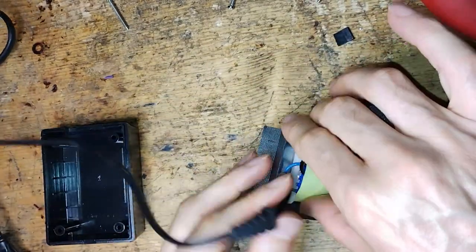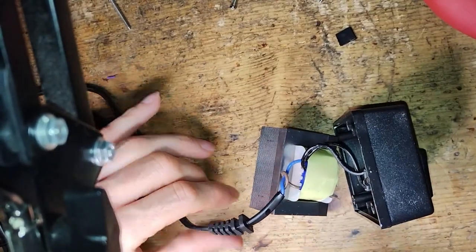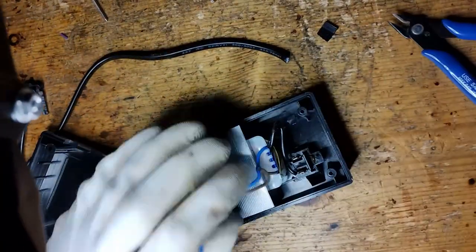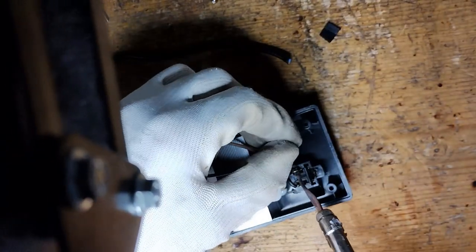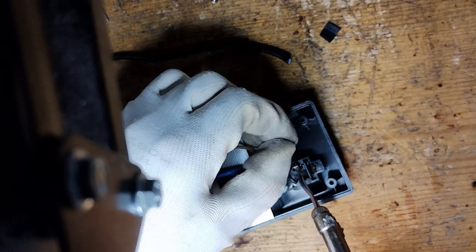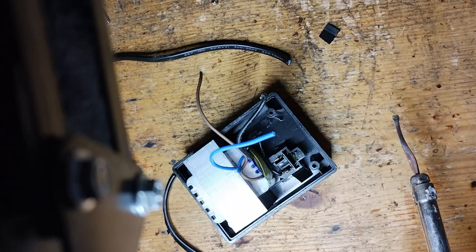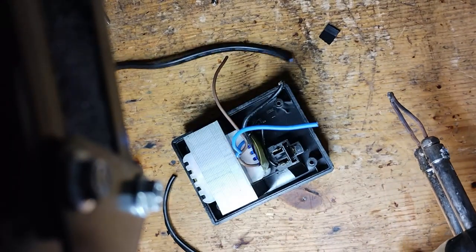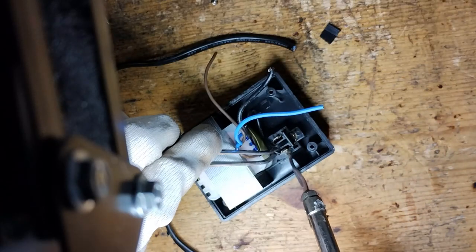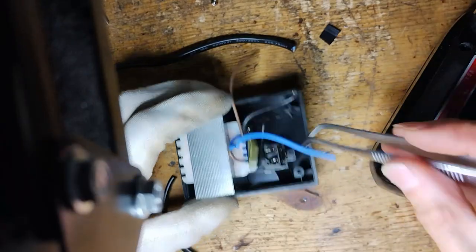First of all, one should notice that the output socket has a ground connection, which is not connected. In this case, the output socket was also connected in the wrong way by the factory, making the supposed output neutral line always elevated compared to ground. This is the occasion for fixing this issue too.